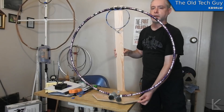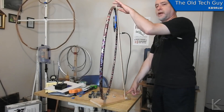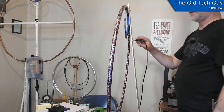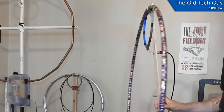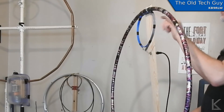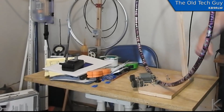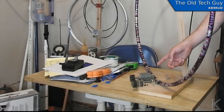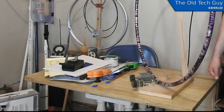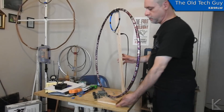This is going to be my QRP night antenna. It's very portable and lightweight. To stabilize it, I took a small flat piece of board, anchored it to the base, and strapped it at the top. I ran the BNC connector through so it's right at the coupling loop, making the connection extremely short. The coupling loop uses the same ribbon as inside the main loop, so the diameter matches. I can tune it from just about 5 MHz up to almost 17 meters, though I've got just a bit too much capacitance - this cap goes to 300 picofarads; I could probably get by with 150 and still reach 40 meters.